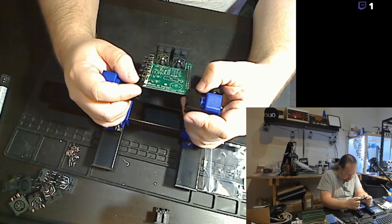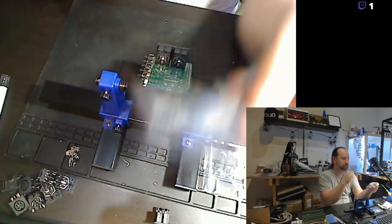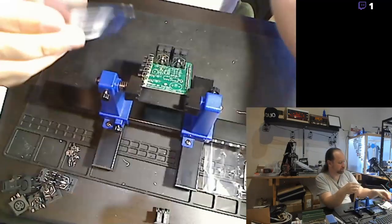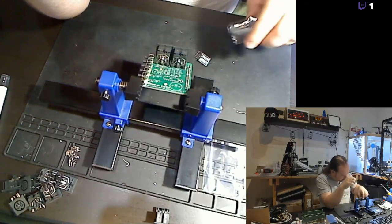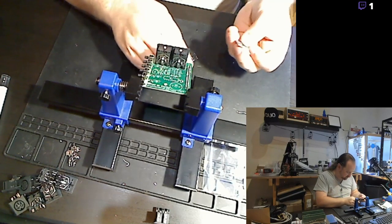Then what else do we have? And I need to get the level shifters. There's actually some 3 to 5 volt level shifters in here because the Raspberry Pi only deals in 3.3 volt. And of course all the Commodore stuff is older tech that's 5 volt. And those two don't play together too well without some kind of device running interference.